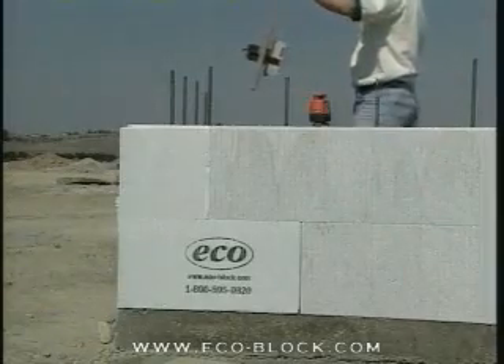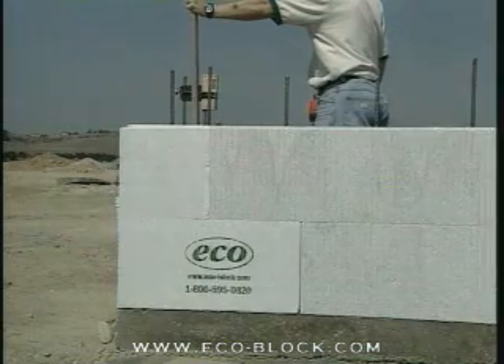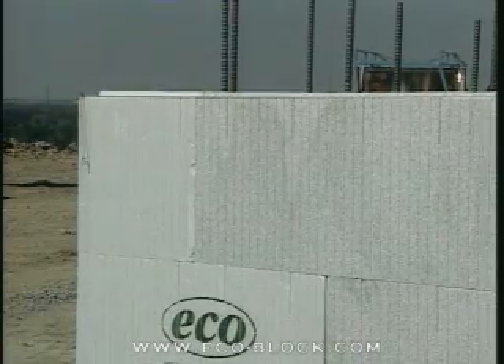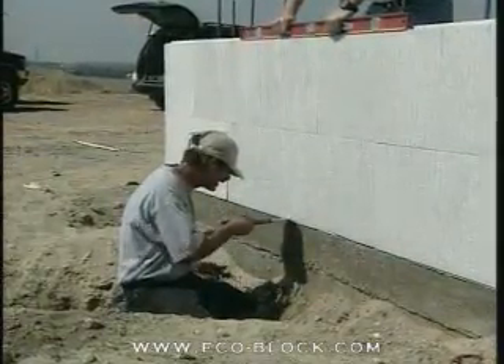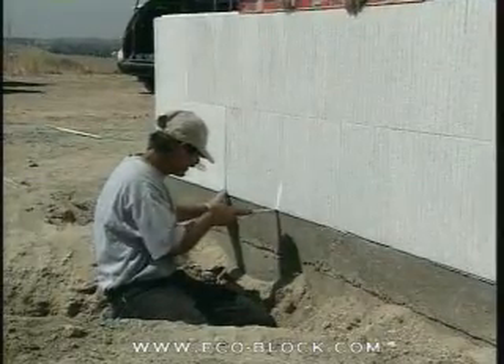The second course is also an excellent time to check the level of the walls. Level is checked by either shooting it with a laser or using a bubble level and pulling a string tight from corner to corner. If there is a high spot along a wall, while someone presses down with moderate pressure, carve out a bit of the bottom of the first course block to make up for the high spot in the footer or slab.